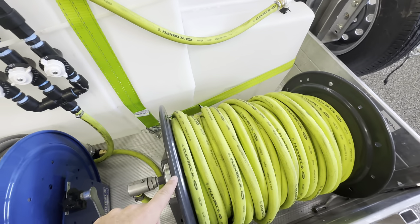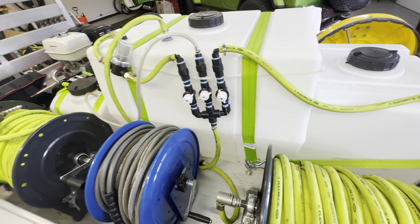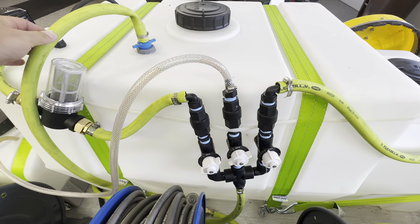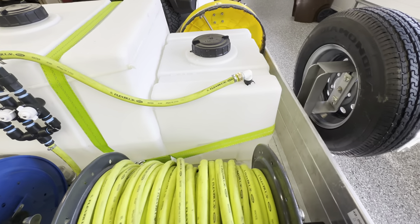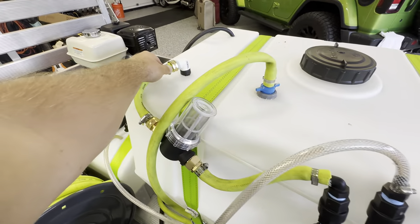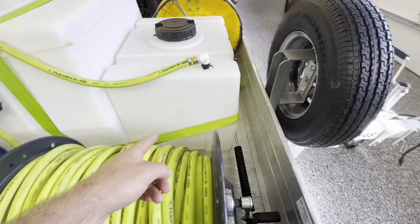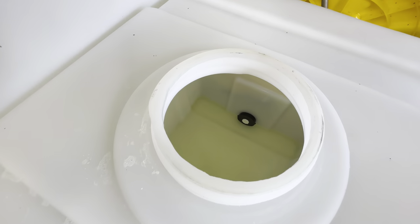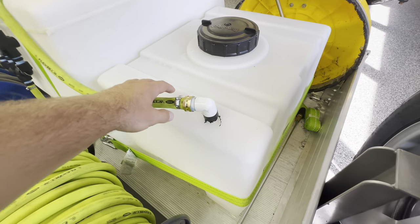This is a 100-gallon tank. This one's a 30-gallon — this is for my SH, my sodium hypochlorite. You can see I've got drop sticks in here as well from my mixer. So this is my 30-gallon straight SH tank. I don't have much in there, but that's straight sodium hypochlorite. I've built a drop stick using a half-inch PVC pipe, threaded to a 90-degree elbow.